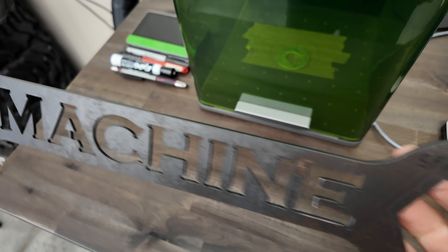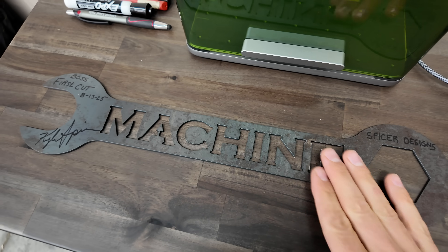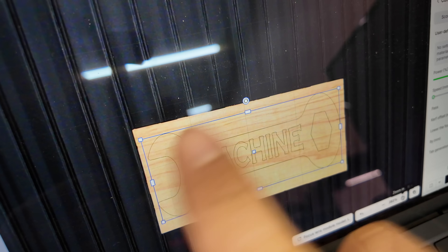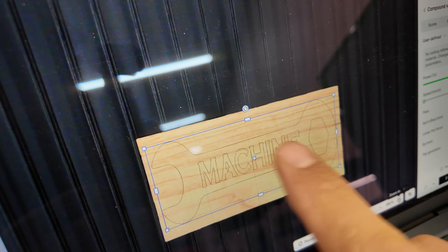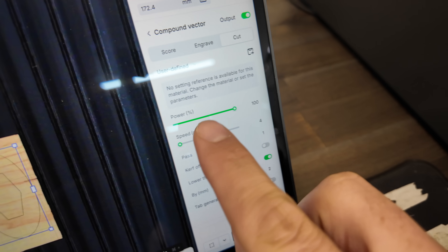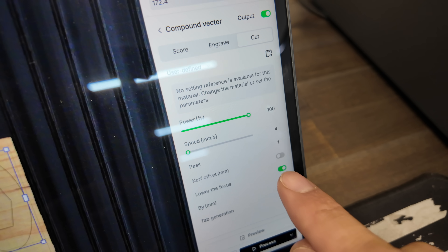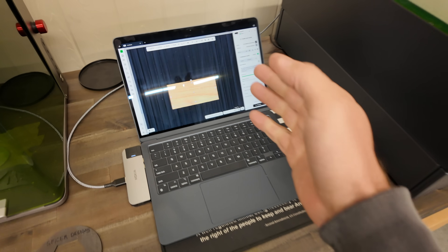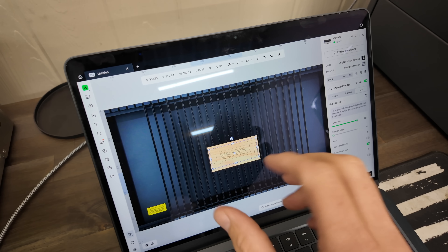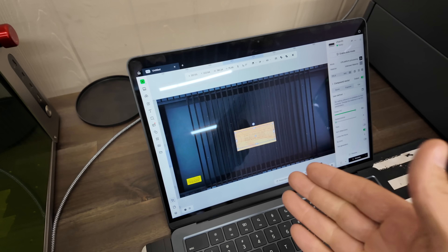As far as what we're going to cut — this right here is 14 gauge mild steel. This is my first cut on the Boss Plasma table. I took a picture of this, uploaded it onto X-Tool Studio, and we have it right there. I kind of fattened it up a little bit so it'd fill out this piece of wood. We're going to see if it can cut out those letters, that whole thing. In my settings, I have power at 100%, speed at four millimeters per second, one pass. I toggled the focus lower by two millimeters. Those were settings provided to me by X-Tool. Like all of the X-Tool stuff and a lot of other laser engravers, it'll take a picture of your material and then you can place your design right over it, making it really easy to put your design accurately on the material.